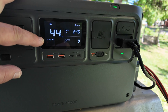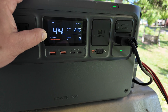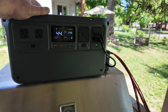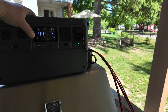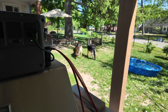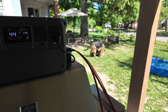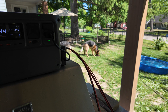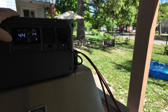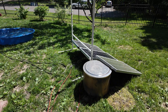So I don't know if this means the charging time is about two hours to fill it up — could be. If it stays like this for two hours, it would be charged. That makes sense and aligns with the user manual. Because if you have six panels — look at that, the input goes down to very little because the dogs walked in front of one of those panels. Just a little shade is going to mess with your numbers. That's why people usually mount panels on the roof, so nothing can go in front of them. With six panels, you can charge this from zero to 100 in two hours, so from 50 to 100 would be two hours with three panels or one hour with six panels. The math seems to work.